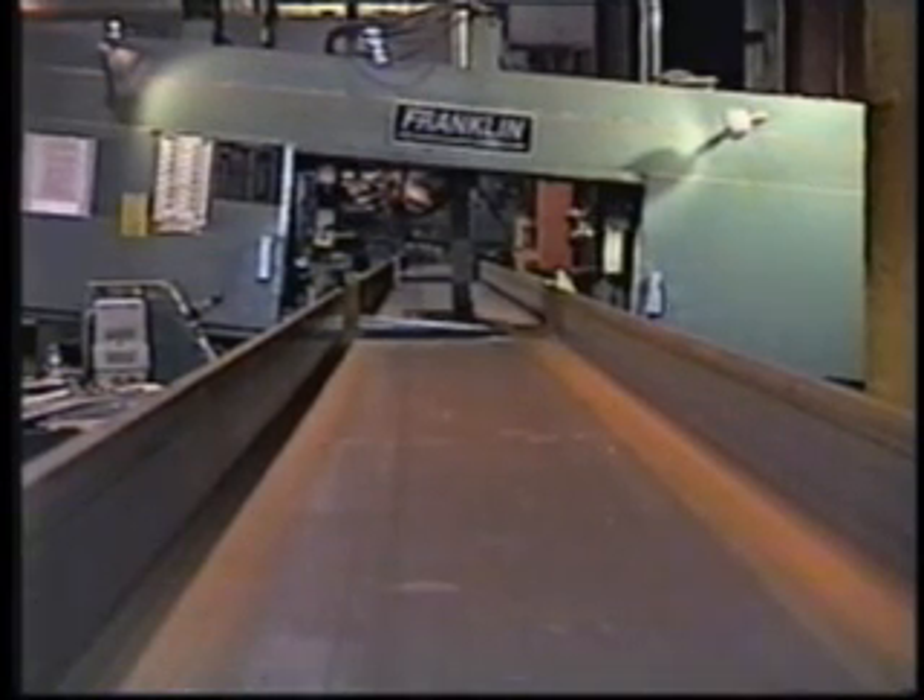This machine is designed and built for increased production rates, utilizing the latest improvements in bandsaw blade technology. Hydraulic features such as vice control and automatic blade tension control provide optimum sawing rates with minimum effort by the operator. The double-column construction provides extremely stable saw frame guidance and stability.